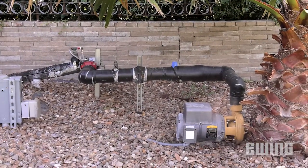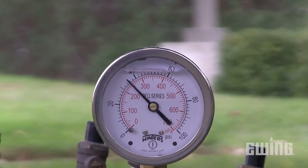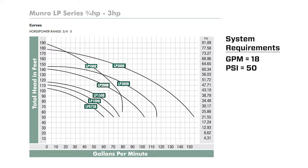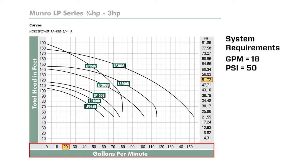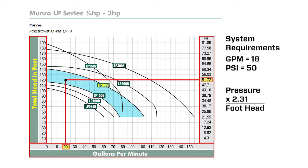If you are boosting an existing water supply with an inline booster pump, be sure to subtract the incoming pressure so that you don't oversize the pump. Now that we know the pump's required flow and pressure, we can consult the pump's pump curve to determine what horsepower is needed. Find the flow rate in gallons per minute for your largest zone on the horizontal axis, then find the pressure needed on the vertical axis. Most pump curves reference pressure in feet of head. To convert psi into feet of head, multiply the pressure times 2.31. The curve above the point where the two axes meet is the pump you need.